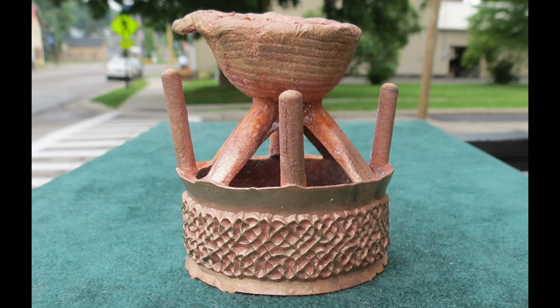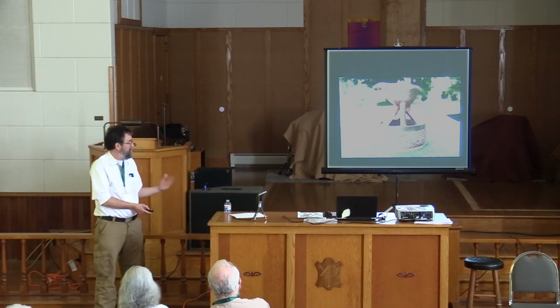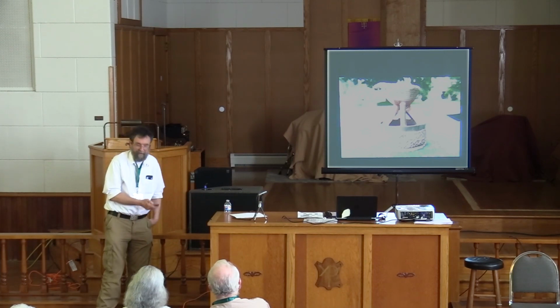And there is the piece after it's been cleaned up. You can see the risers that I built into it right here, and they didn't rise all the way up to the surface of the mold. So the metal was, or the mold material was hot, but it still chilled the metal. And also the sharpness of the lines here, they're not as sharp as the mold was. I did some other tests, not completely carving like this, that show that you can get them sharper with practice and changing some of the variables.